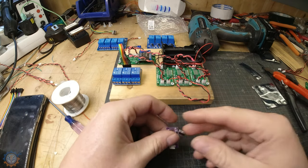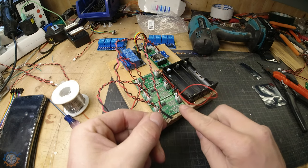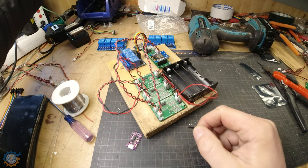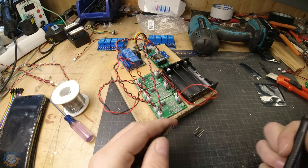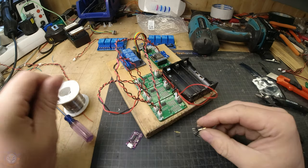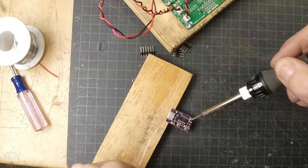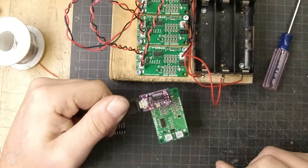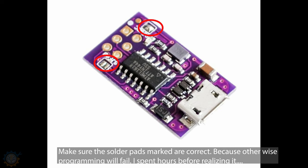It's now time to program everything, and I'm using this tiny AVR programmer. The headers that come with it are male headers, and I have already soldered male headers on the monitor modules itself, so I'm going to add female headers — I like those better to actually attach them. So I'm cutting that up and soldering them into place on the programmer. Programming is straightforward, and you can do it directly where the boards are. But beware of making sure the pad on the board is properly soldered, because if it isn't, you will not be able to program.